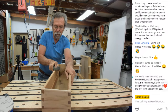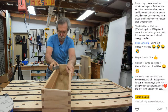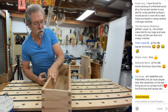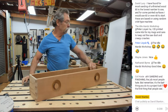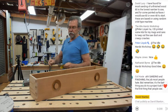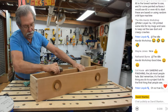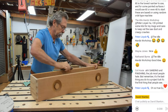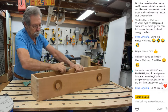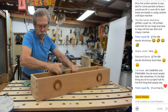And over the top. Needs a little bit coarser on that. The reason being, it's got a couple of chatter marks. I'll use some 180 grit paper down there, see if that'll do it. You can hear it cutting much better. And the inside.